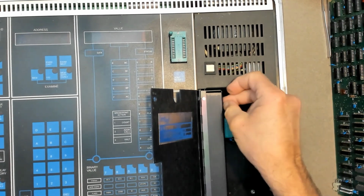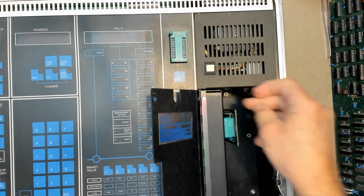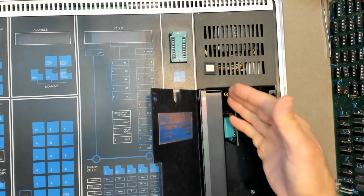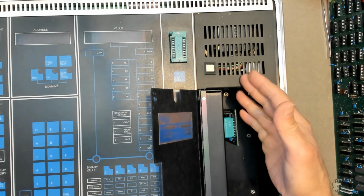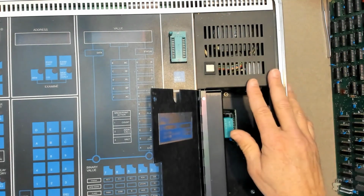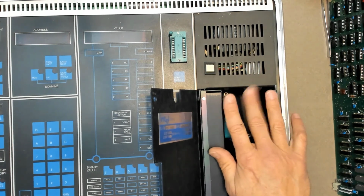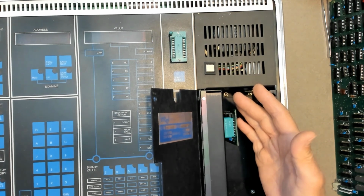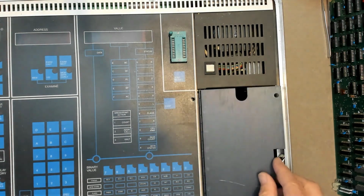It's in that little hole right there, and I guess it's a lot like noodling catfish, I suppose, except the post doesn't actually bite down onto your clip, but you stick something in there and you fish around until you grab a hold of something. And then, there's actually no ground connection to reference the scope. So hopefully you included a ground point on your system under test, because Intel sure didn't include a ground point anywhere on the board. So you see, this is why when you see a really odd design choice in an Intel board, so often the glaring, half-baked design decisions jump out at you, making it harder to see when an odd design choice was put in as a feature rather than an oversight.